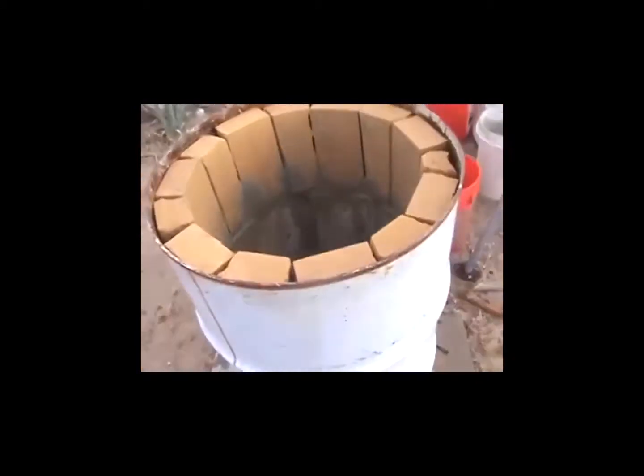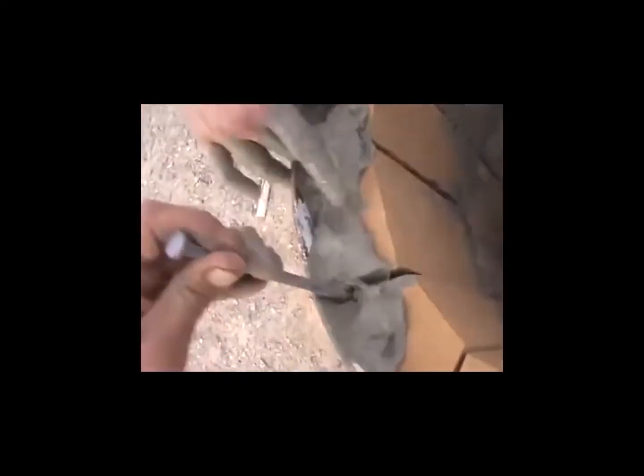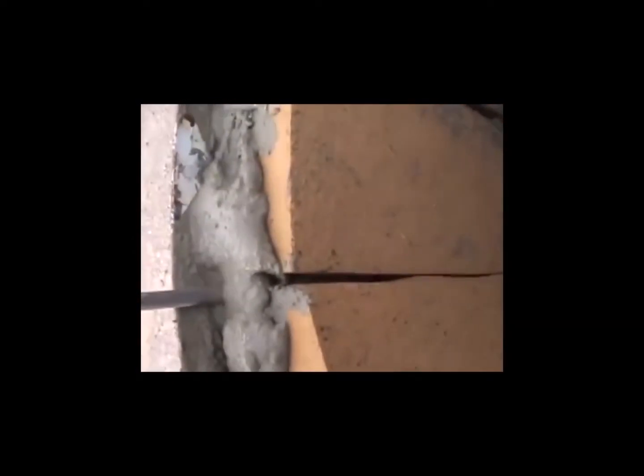Our last chime is in. We're about ready for a size 60 crucible. We just kind of poke it down in there to get good penetration — you can see we're getting down into the crack there. This is looking pretty good. Let's make sure we've got good solidity down here. I'll put a little more down there.